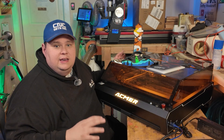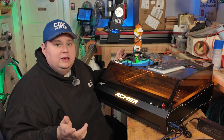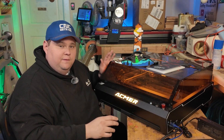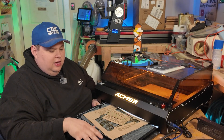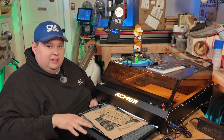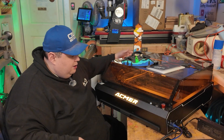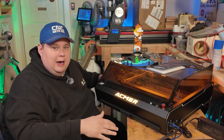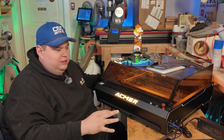So what do I think about the Acemer P3 now that I've had this for a couple of weeks? There are lots of different things I can do with this machine and I've been really, really impressed. I want to mention the bottom tray — it comes out all the way, which allows me to clean the honeycomb and any cutoffs that fall underneath it. It also allows me to completely remove it and do longer pieces if I need to slide them in and out the other side. I can also put this on top of a larger item with the tray removed and engrave the whole surface — like a big tabletop. So this is very, very versatile. This is a beginner machine, and at this beginner price point for this type of diode laser, I am continuously surprised with how versatile it is.